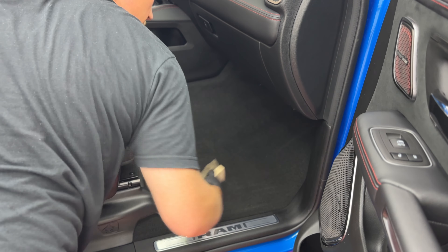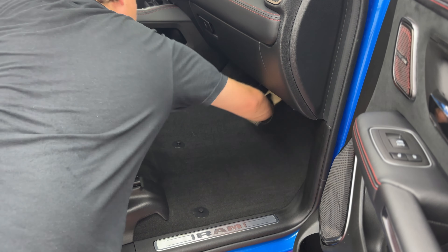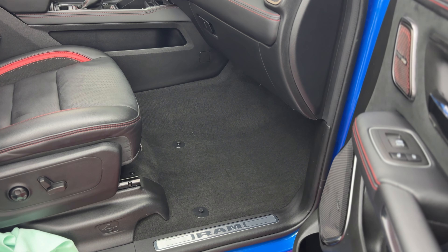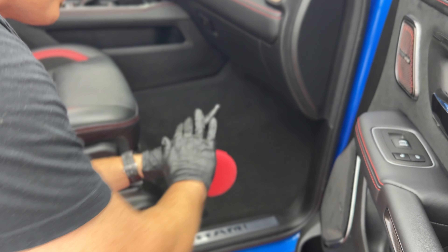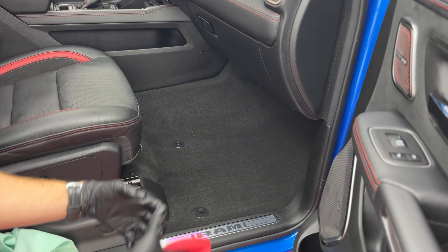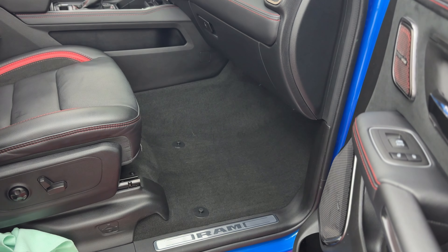What's the importance of two coats? Just to make sure those fibers are fully coated. These are synthetic fibers — not wool, not nylon. What you want to do is keep carpets clean, because when they get dirty you can wear down the carpet fibers to the point where all those dirt pieces grinding in there sand down the finish and it looks completely different. We're not only protecting how it looks, but we're protecting the integrity of the fiber. The coating is not some superhuman shield, but it will give the fiber a chance against degrading. If you stain something, it'll clean off easier. We're giving these fibers every fighting chance early on to make them last as long as they can.